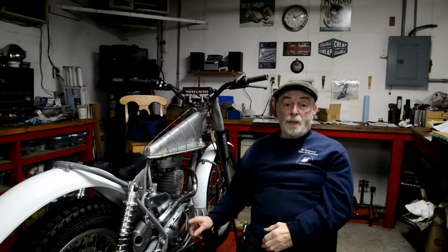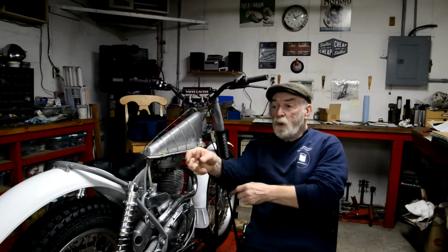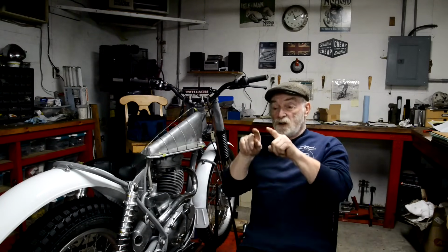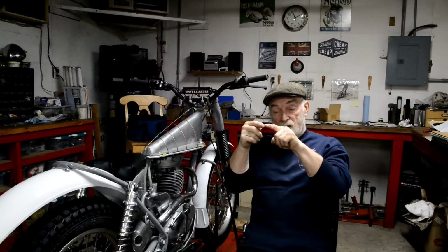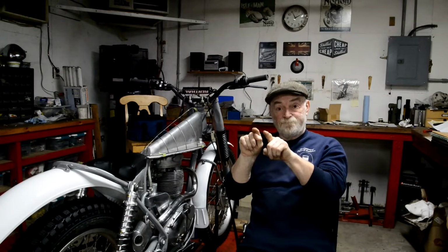I did have one comment about the BSA engine being harder to turn over than a Triumph, so the weld maybe wouldn't hold. Weld isn't like glue. If things are welded properly, then the two parts that you've welded together become one piece. So, for instance, when I was training to be a slinger, British Steel Corporation, Grangetown Works, number 9 mill, one of the things which intrigued me in the training was we talked about chains, and a chain link goes round and then it's welded. Well, when chains snap, if you check them, it's never the weld that snaps. It's always on the corners. So I'm not worried about welding two kickstarts together. They'll be fine. And plus, don't forget, this now is really low compression and we've got the decompressor and everything like that, so that's not going to be a problem.